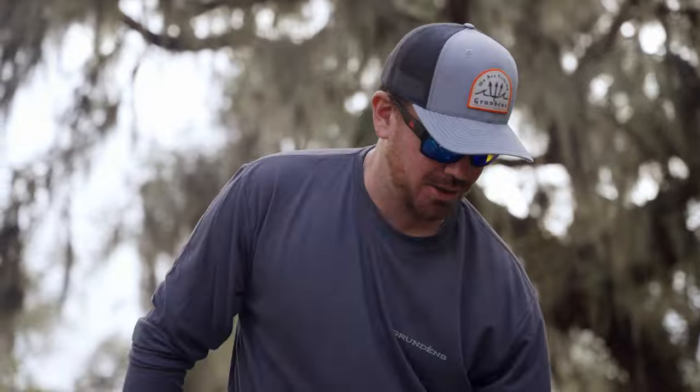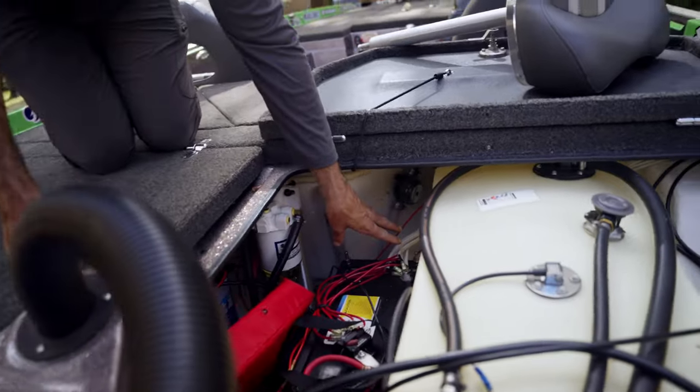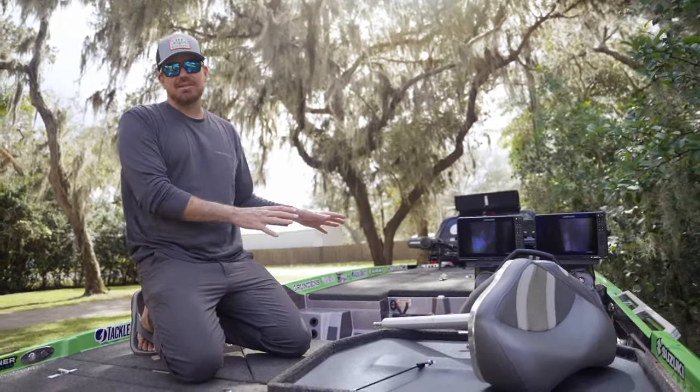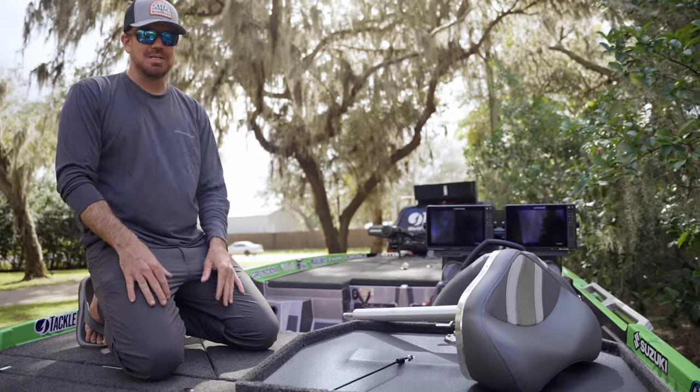I'm probably most excited to show you guys the back of the boat. Everybody has their own way of rigging up boats, and one thing I personally like to do is have Bass Cat literally send me the boat not rigged at all — I like doing all the rigging myself. Two reasons: one, if something were to happen, I know where the problem more than likely is because I installed it. And second, I like upsizing everything. I've got individual dedicated 10-gauge wire going to each unit, cutting out any type of interference. I've got a dedicated 12-volt battery just for my electronics, which is huge because between electronics and forward facing sonar you really need a lot of power at all times.